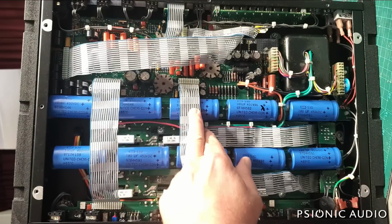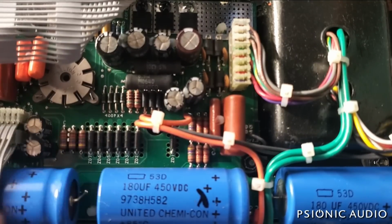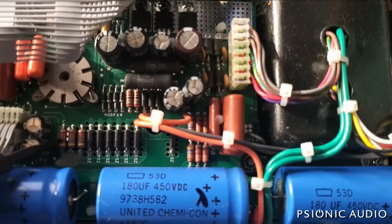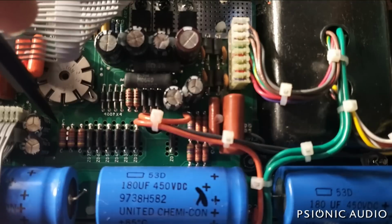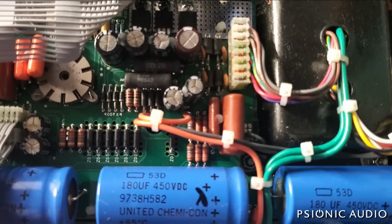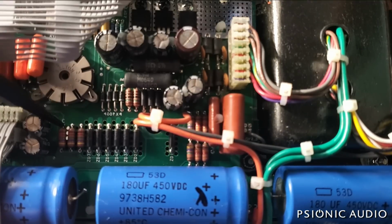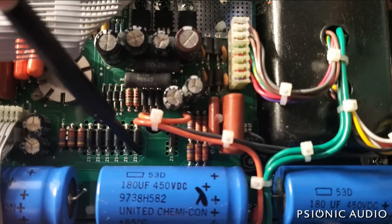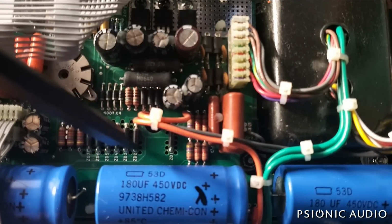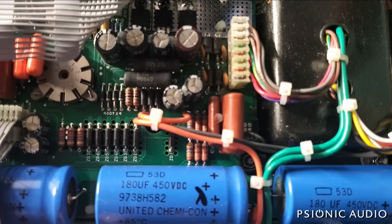So let me check some things. All right, mystery begins to unravel. These three resistors here are not 15K resistors. If I squint, I can see that these three are in parallel with each other. So instead of one half watt 10K or the one 3 watt 10K, they have three 3/4 watt resistors that add up in parallel to be 15K, and that is tied coming from this node here at ZD2. And this string of Zeners here is a dropper for the